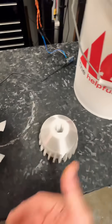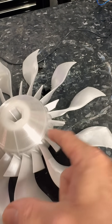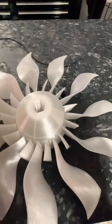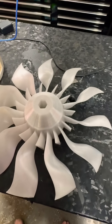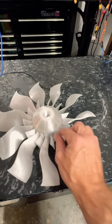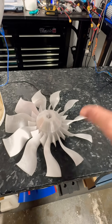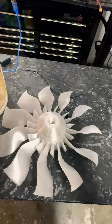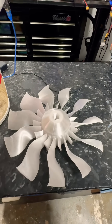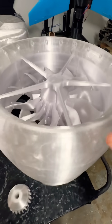We are looking at 9,000 RPMs — these blades have been tested up to 5,000 RPMs, and I think they'll handle nine just fine. I may add thin CA to set these permanently just to be on the safe side so I don't get a blade that slings out. At the same time, I don't know if the CA is going to make the entire system more brittle, so we may test two fans — one without CA and one with CA — to see if that reinforcement actually helps or hinders.